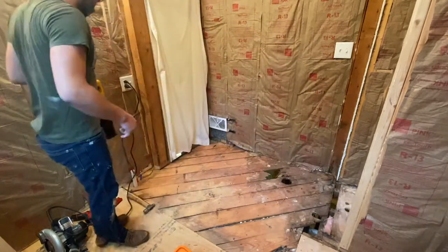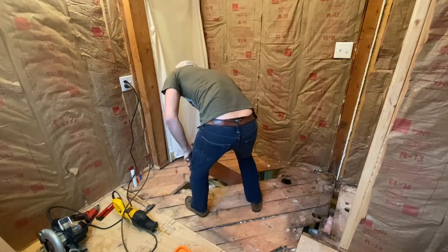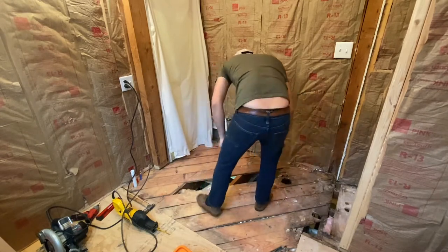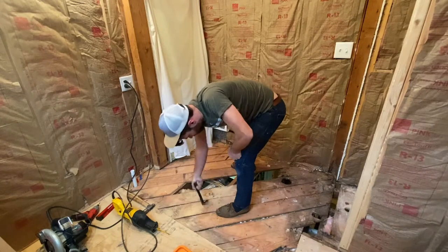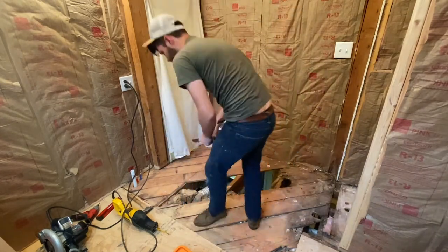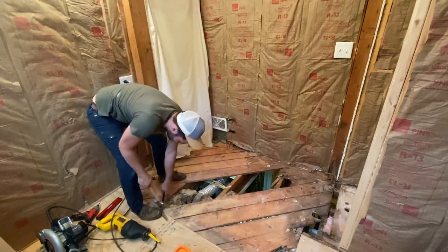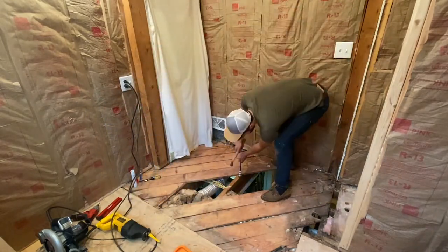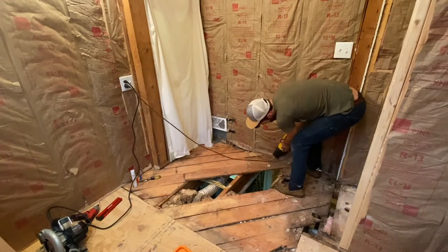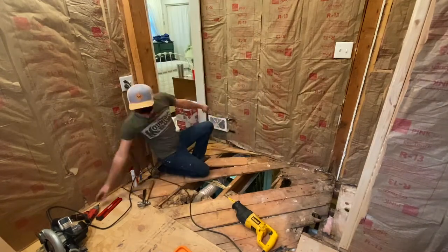So make sure you change that out. With the sawzall it's not as important because I just have a metal-wood blade already on it, so hitting nails isn't really going to damage it much. As I get close to the floor joists with my sawzall, I'm going to be very careful not to cut into that — I don't want to weaken the strength of that support at all.